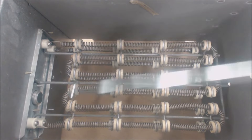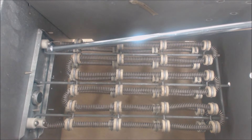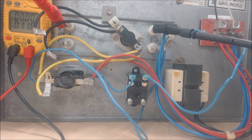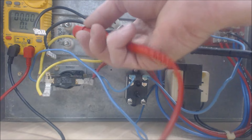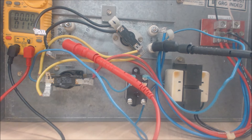These are your electric resistance heat strips — the power is off. Power comes in from here and goes to here. The other electric resistance coil is down here and goes to this point. We see 11.9 ohms, or about 12 ohms of resistance. When we see resistance we know that work is going to happen. Checking this side: whenever you're taking resistance you have to isolate the component you're testing to make sure it's not back-feeding from resistors on a control board or something. We again get about 12 ohms of resistance, so these coils are intact.